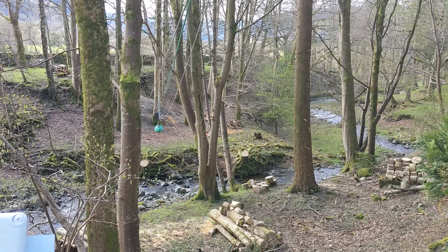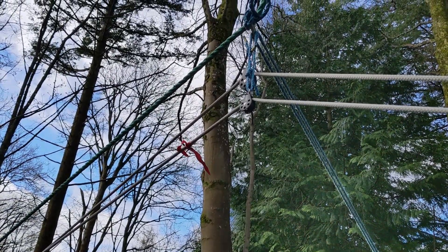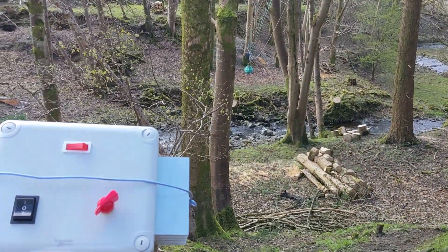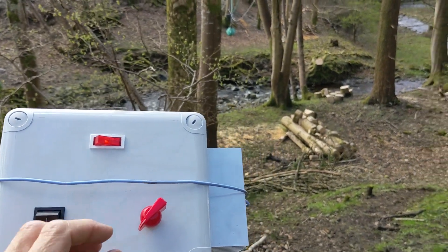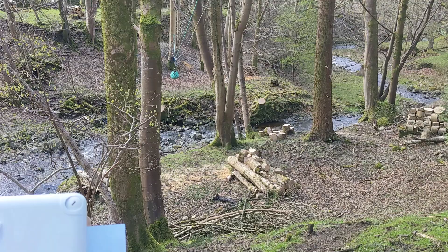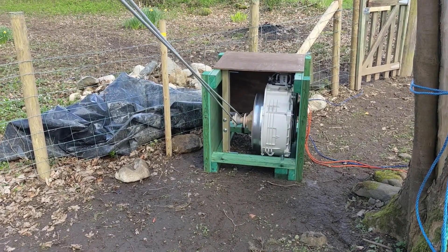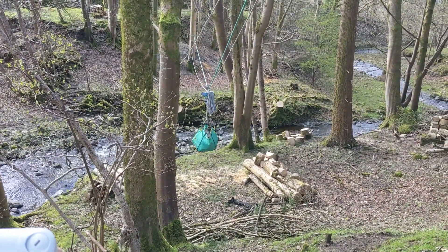We are again at the top of the lift. The red tassel up here is on the inactive side of the loop, so it tells me that when the tassel is up here the trolley is at the right place at the bottom for loading. To bring it up it's as simple as turning the power on, engaging 'up' — two is up — and turning the little knob. We should hear behind us the spin cycle starting, the familiar noise of a washing machine, and there goes the tassel. The washing machine is doing the work via its upper capstan winch, which I'll go over a bit later.